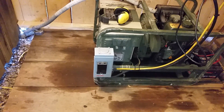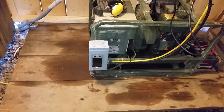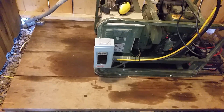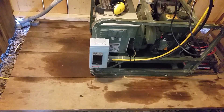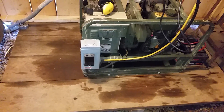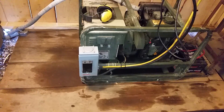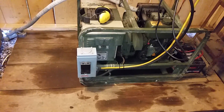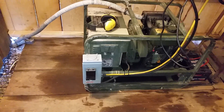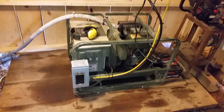It's got a big enough job just to make sure it's doing its overcurrent protection. Trying to do the overcurrent protection when you're being shaken to death — that's probably asking a little bit too much from that Square D breaker. Some of you might have said he better get that sub-panel off that frame because he's going to have a problem. Well, 100 hours later, the breaker's saying it can't do it anymore. I'm really thankful that the inverter caught the problem and just says the power isn't clean enough — it's just going to shut off and go back to running on batteries until you can get it together. We got it together. Hope that helps somebody. Have a blessed day.